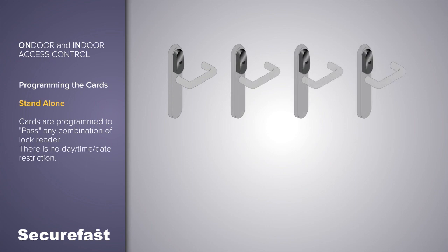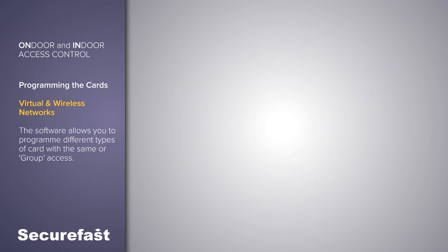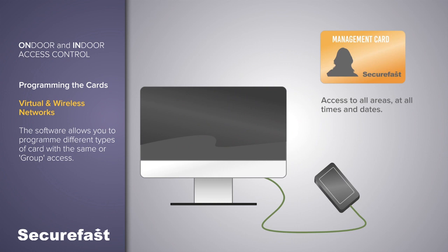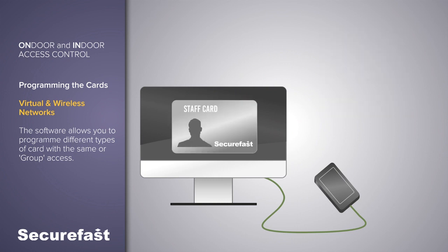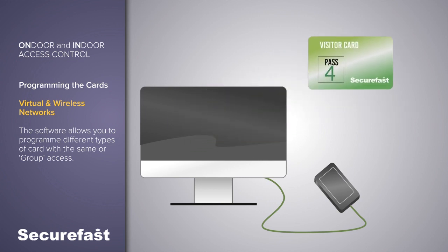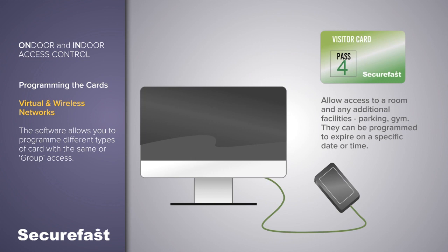Standalone locks are only recommended for a small number of doors. Virtual and wireless network software allows you to program different types of cards to different access levels. For instance, a staff card will allow limited access on days and times and restricted to certain doors, whereas a visitor card for a hotel would enable you to enter your room and also probably the car park, gymnasium and main entrance. These cards are also programmed to expire at a certain time, i.e. 12 o'clock for each day at the hotel.